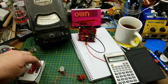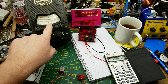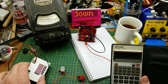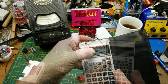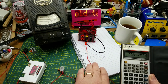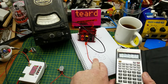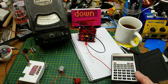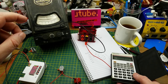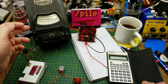Let me crank the voltage up. Now we're showing mid-scale 30 on the meter, which should be 66 microamps. Over here we're showing 15.12 volts, which calculates out as 84 microamps. So for mid-scale 30 we figured 66 microamps but measured 84 — it's a little off, but what do you want for a meter from around 1926?